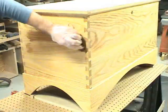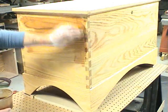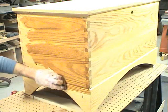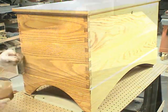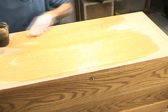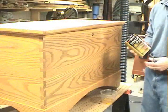The second step is to apply an oil-based stain. We work this into the grain and then wipe off the excess almost immediately. Here you can see the alcohol-based dye going on the top. It's really a pale yellow, but it sets a nice warm undertone to the wood.